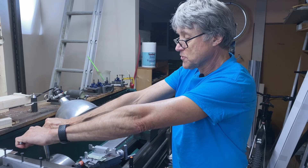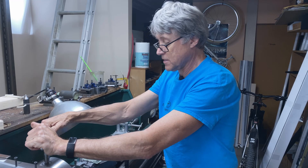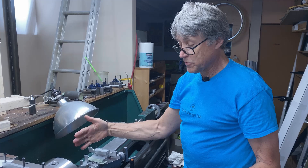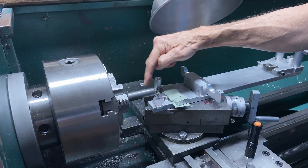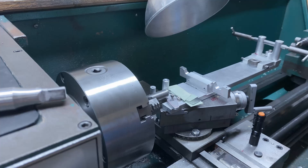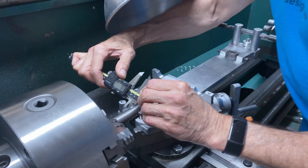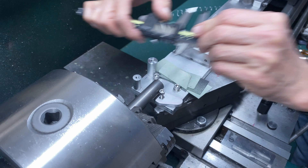If I take out the hole saw and put in a three-quarter inch rod, that can be a constant — because when it's held in the chuck it might be out a thou or a couple thou, but it's not going to be out more than that. One of the things I did was put this piece of half-inch aluminum there, and I've got this centered as best I can. I take a vernier and measure in between here and here, and I've written that down in my notes so that next time, when I put the same rod in, if I get the same measurement, I know this is exactly where it was last time.